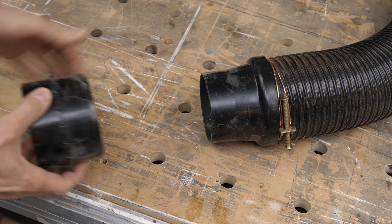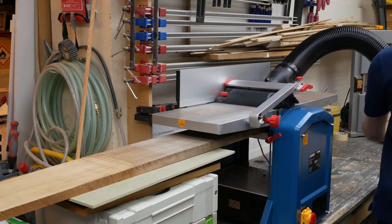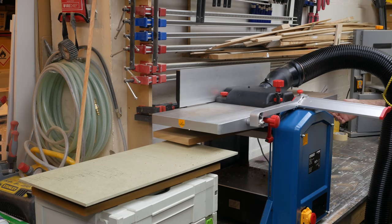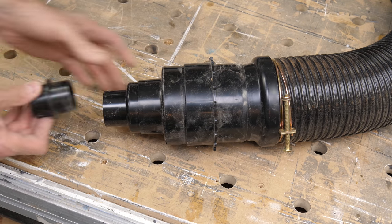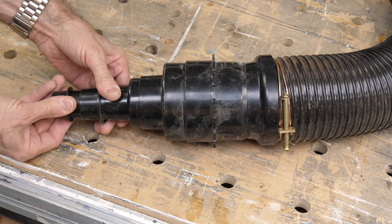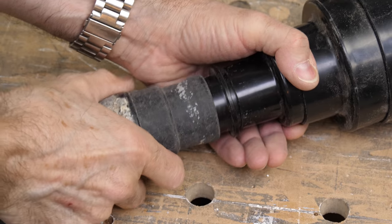You're almost always going to be using it with an extension cord. With that irritation aside, it does come with a variety of step-down connectors for the hose, which are very useful to adapt it to other tools. At 100 mil with the planer it's okay — it captures the bulk of the shavings. But step this hose down to 65 mil for the table saw, or 50 mil for the bandsaw, or even 36 mil for the chop saw, and it's absolutely fantastic — it would suck the chrome off a bumper. Below that, down to 27 mil, it does choke a little and doesn't perform so well, so if you have the option of 27 or 36 mil I'd go for 36 mil every time.